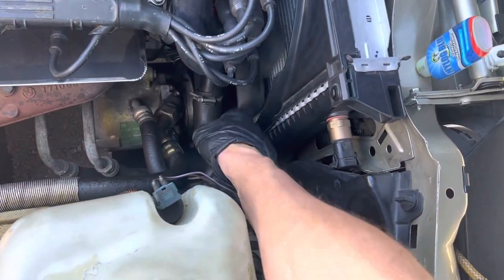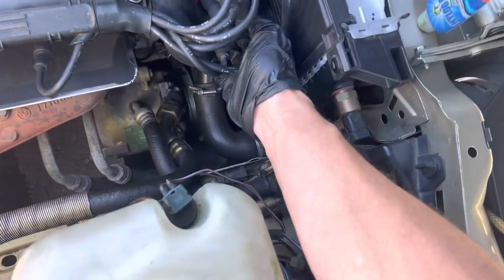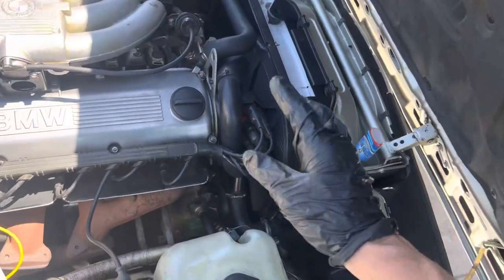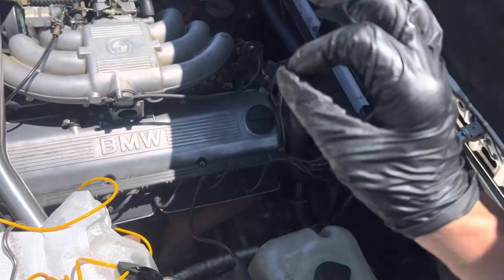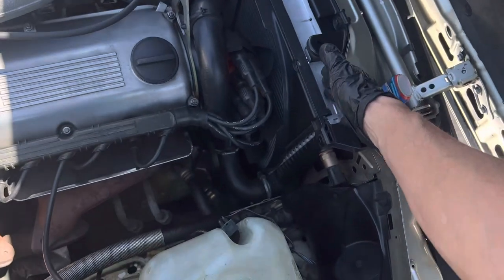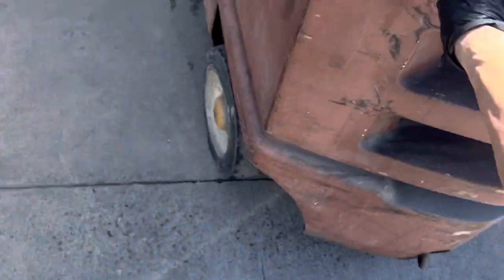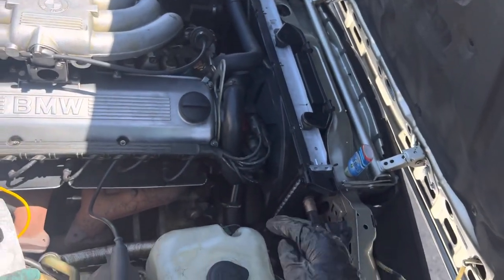Going around — use your fingers, spin the clutch, wiggle the clutch. Try to check for grease on the front of it and see if it's splattering oil anywhere. But even if it doesn't wiggle, there's no oil splatter, and it feels tight, it still could be out of calibration — it uses a fluid friction and a bimetallic spring that go out of calibration. They're really only good within 30 to 50,000 miles and start drifting. You'll never see an engine temperature change because the radiator is oversized, but it makes a big difference for AC condenser airflow. You'll suffer with your air conditioning but see no temperature rise on gauges when this goes defective.